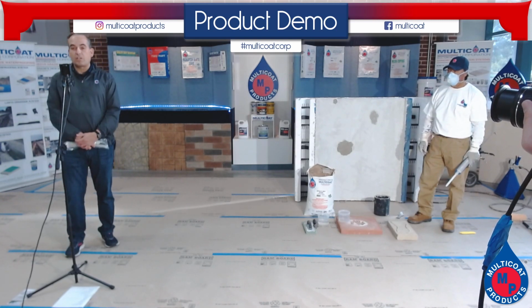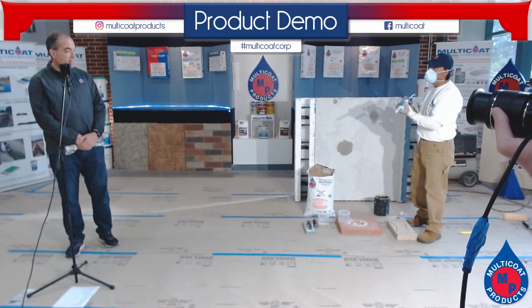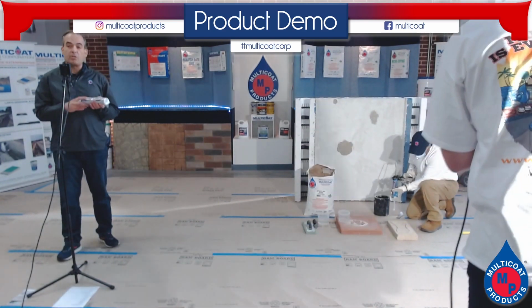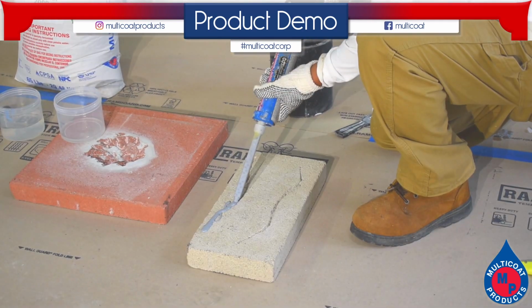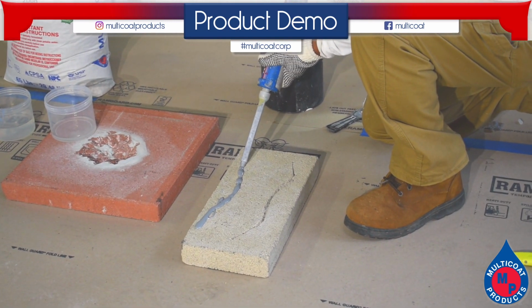So today we're going to start by doing concrete repair. And Alfonso over here is going to show our Speed Bond product. Our Speed Bond is a crack repair product. It's a polyurethane. If you have a crack in your concrete, chase the crack and then come back with our Speed Bond and cover the crack.